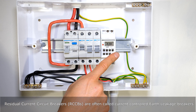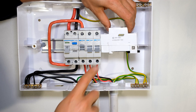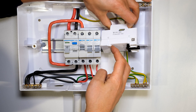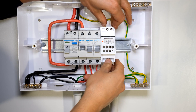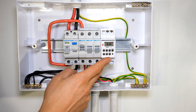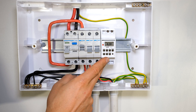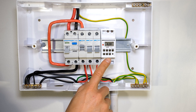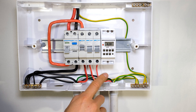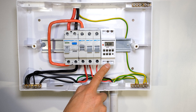My earth leakage is down and now I'm going to install a timer. The first one is the MTD8 — this is a 20 amp timer. At the back there are two spaces and a clip which moves, so all I need to do is clip it onto the DIN rail and then depress it down. Because this is a 20 amp timer I could use this for a light, a small pool pump, or even a boiler. Keep in mind that if the load is inductive you will have to derate the current carrying capability — for example this is 20 amps for resistive loads, but for inductive loads you may get a lower current rating. Please consult the specification sheet of the timer you have purchased.